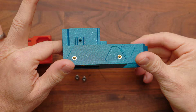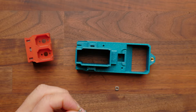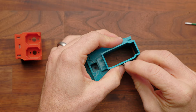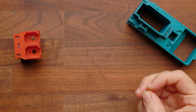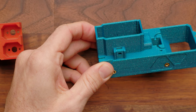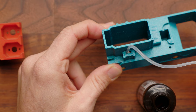Next, we're going to take our center core and install two square nuts on the two sides. If you find they are too loose — tolerances will vary print to print — you can use a little CA glue or cyanoacrylate super glue to hold them in place. We recommend a real thick cyanoacrylate; just put about a single drop on the top. If you have it, you can use Instaset — use the dropper to get a single drop rather than the spray since this is such a small area — and that'll set it up nearly instantly.